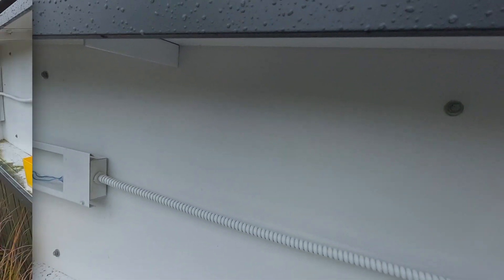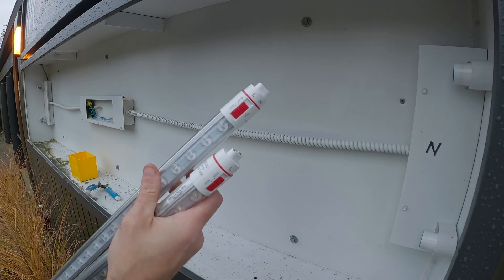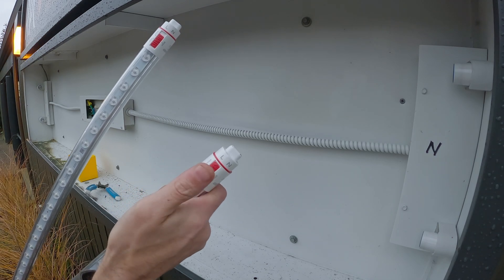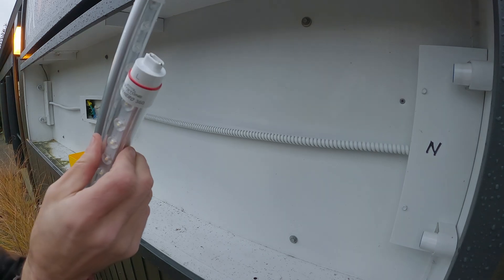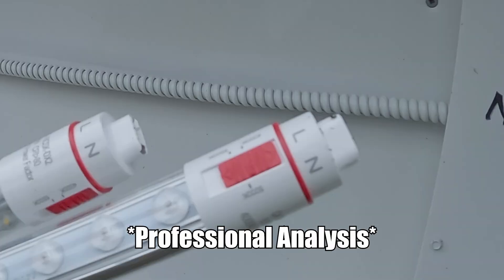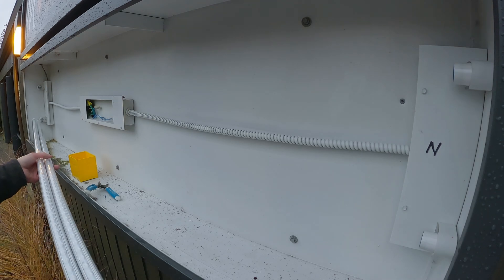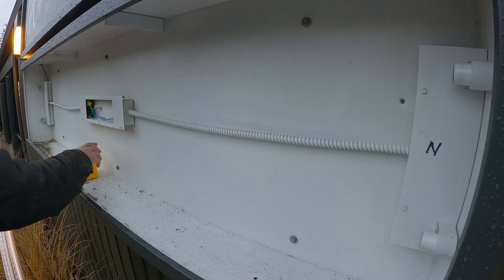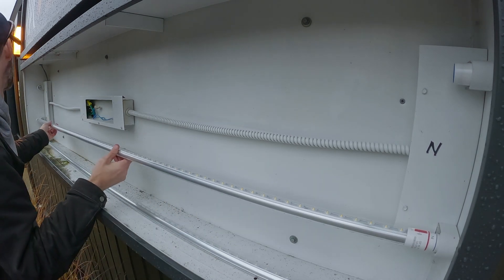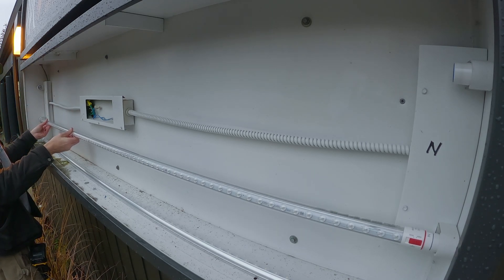Let's pop these lamps in. Grab our new lamps and hope we don't roll down the hill. These ones have selectable color temperatures — you can do 4,000K, 5,000K, or 6,500K. Let's do 4,000K, a little warmer. Each end has an L on one side, and this side has an L and an N. You put the L side on the L side and the N side on the N side — super complicated. You almost don't even need to be an electrician to do these, although if you do this work, you do need to be a certified electrician. And they just rotate into place like that.